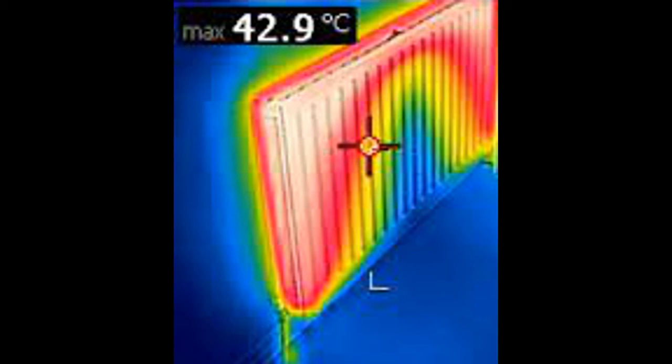You can see any instant change you make — like flushing out your radiators — and you'd see the temperature difference straight away. For balancing your radiators, you can check the temperature of each one directly and get them balanced more finely than before with very accurate readings. And for black sludge, if you want your home checked for heat retention, drafts, and insulation performance, this device will tell you temperatures very accurately so any improvement you make will show up immediately.